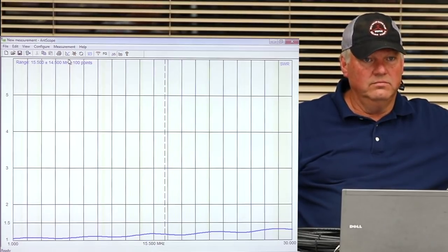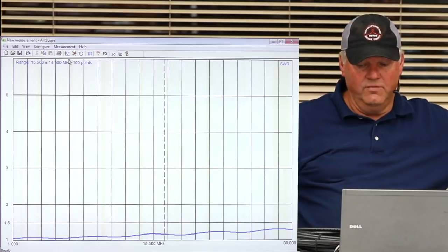Whoa. Look at that. That's a little over, it's about 50 feet. What? Because it has lower capacitance per foot, has lower loss, it's just better coax. I think Art said it all when he said 213 mil-spec type coax. That's what this stuff is. It just friggin' works.